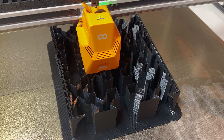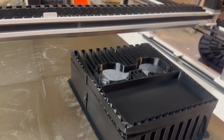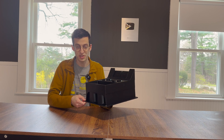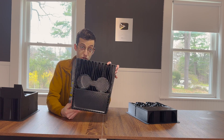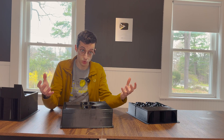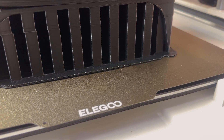Here's another big print — a center console for a Pontiac Firebird for a friend. This took about 30 hours to print and three tries to get right, mainly because I was printing it with PETG at a bed temperature of 90 degrees Celsius, drawing 1,200 watts while printing. For my first attempt, I used a grid support pattern, which was a very bad idea. As PETG cools it shrinks, and with all the lines going in the same direction, it caused severe warping. The print stuck so well to the build plate that it actually peeled the build plate off the 3D printer.